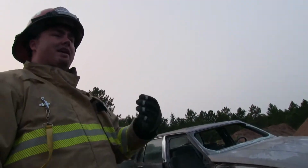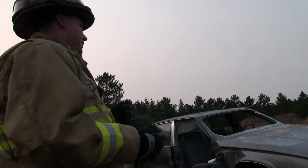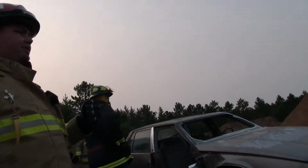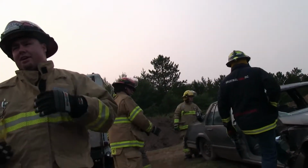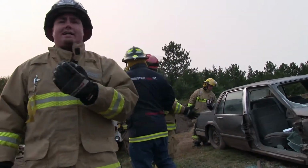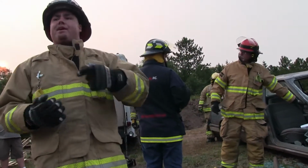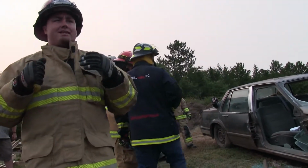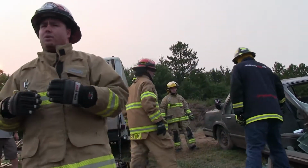Winter's coming up and it gets super cold, and what does that do to the tools? Does that make them inoperable? What's going on with that? Through the manufacturing and everything, we found out that you only lose about 4 to 5 minutes of cut time. So like Adam said, you have 30 minutes of cut time on a normal day like today, where in the winter time you have about 25 minutes of cut time. So you're really not losing anything by having a battery operated tool.